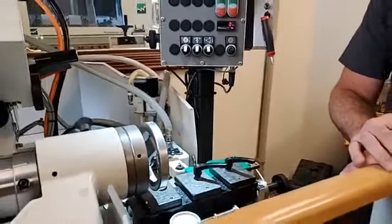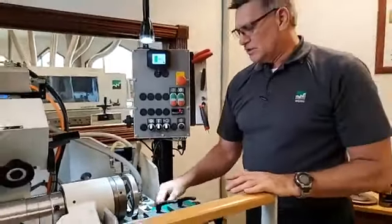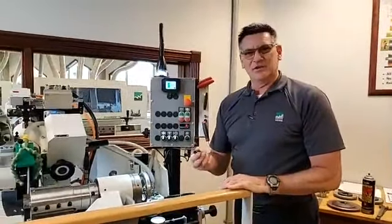Sean, how often do you need to check the consistency of your tracing pin? Repeat the question. The question was, how often should we check for consistency in the pin? Every time you grind or every time you go to a new profile.